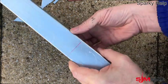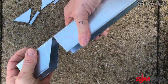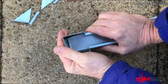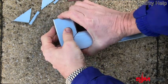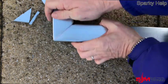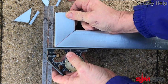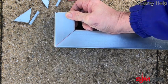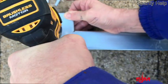Once you're happy with that, it's a case of checking it and then ultimately bending it into place. Just nip them in so they go one inside the other, leaving the cut edge on the outside so it looks like a mitre joint. They should all tie up like that. Just get the square to show you that it is actually 90 degrees. You need to make sure you drill the holes so they're at 90. And that measurement from the back to the end will be 100mm.